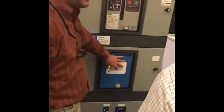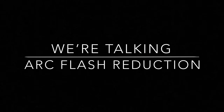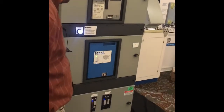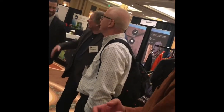It looks just like a magnum breaker — it sits in the same cradle as a magnum breaker. That's the device you have to swap out, so think about it like the airbag in your car: when it fires and does its job, it has to be replaced. In a switchgear lineup, there are models where you have to arm it, but this one is always active. And it takes up a lot less space than those other products.